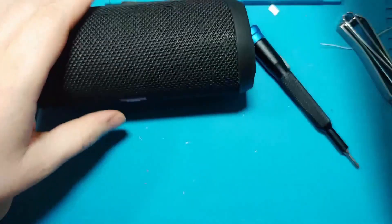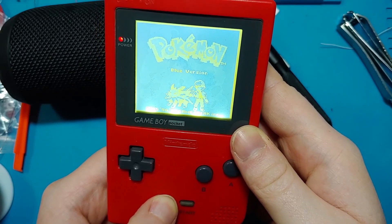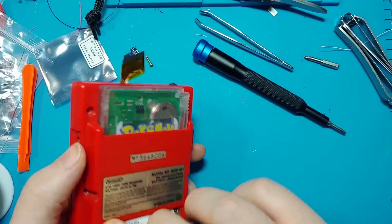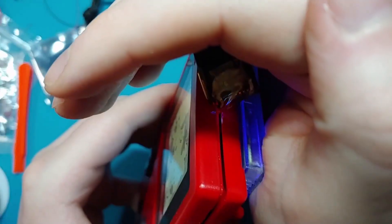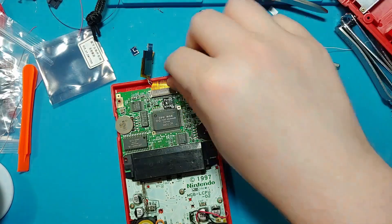Again, pretty bulgy. Okay, so that's currently coming from the Game Boy. It's pairing. There's something happening with my screen — that's pressure. This might sever the wires having it hang out like that, but it makes testing a lot easier. There's that little flashing blue light in there — that's going to tell us if we're connected or not. I'm holding down select right now and it's still not working. I could get it to pair when it was outside of the case, but when it was inside the case it was bulging and pushing on the screen, and it wouldn't pair. I know there's a way to get this in here somehow — I just haven't been able to figure it out yet. So at some point in the future I'm going to have to come up with a way of doing that.